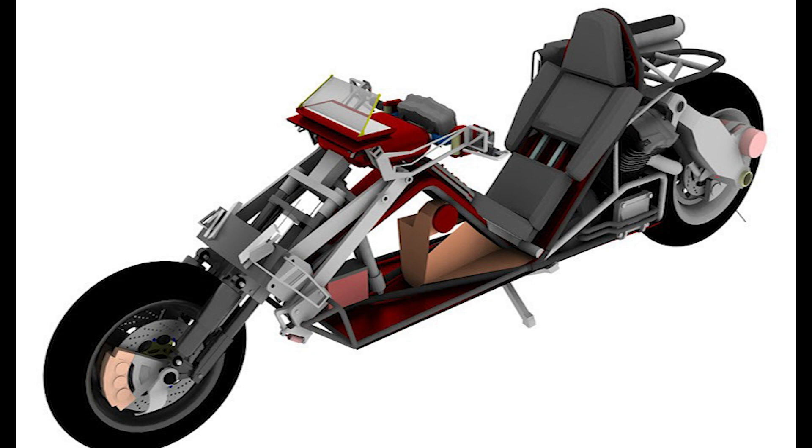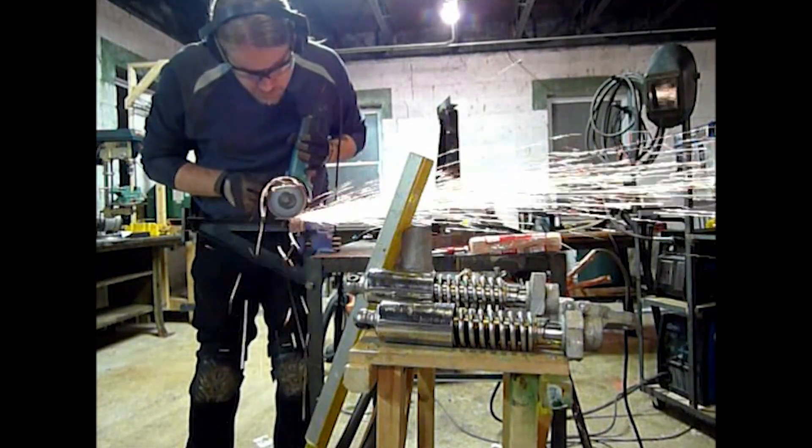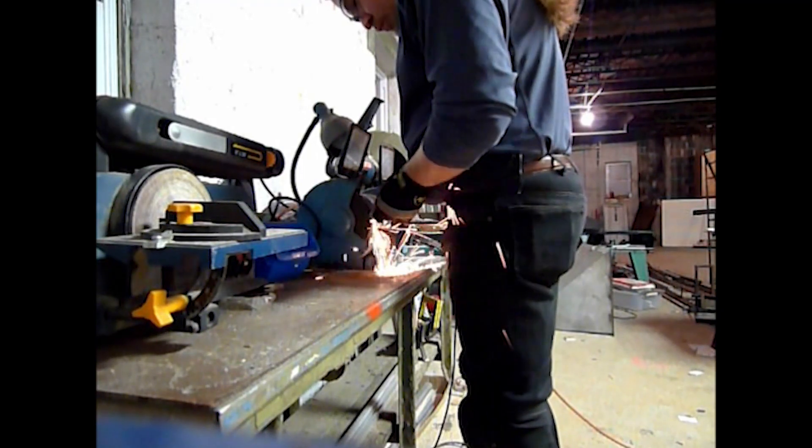Here's a full view without the cowlings. The gas tank has been moved down under the seat for better weight distribution. The forks are again a conventional parallel tube fork design, still split though, allowing the front end to rise up around the virtual pivot point assembly. The front end is still a leading link while the rear will be a single-sided swing arm.